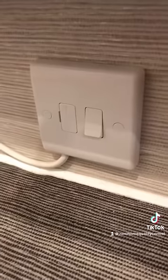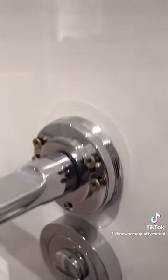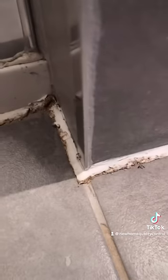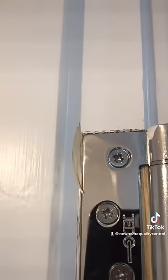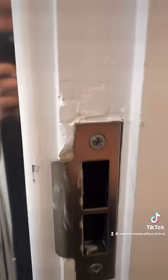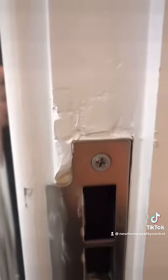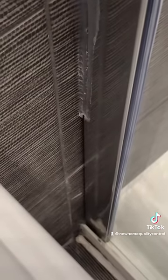This switch is loose under the radiator. There are no through bolts in the door handles — that means the handles could just be ripped off, which would be bad in a fire. There are holes in the edge of this door. Look at the state of this mastic — shocking. This shower console hasn't been sealed, so that'll allow water ingress. Door linings are damaged — absolutely shocking. Look at the state of this latch, and the lining. Numerous marks on doors and architraves, incomplete seal and poorly dressed mastic around the shower framework, and this wall is out.